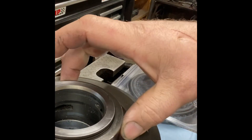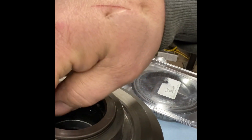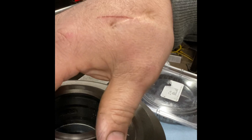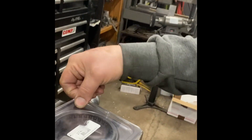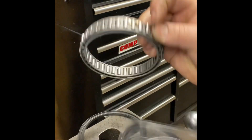The OD of the race you turn down to about 3.5 inches. The one I got had ski jump grooves in it — you get to the point where you just about get them all off; there might be a couple you can barely see, but it's cleaned up and it's the size you need. I'll put a link in the description for the sprag I found that's cheaper than what I paid. When you put it together, the sprag comes with outer races — you don't use those, so discard them. You just use the sprag itself.